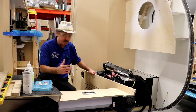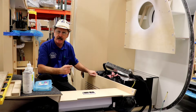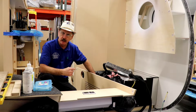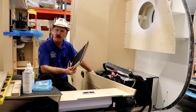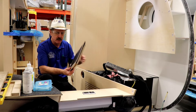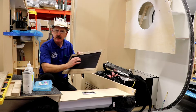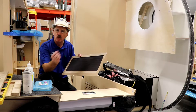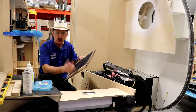Because this is an air conditioning unit, it does have a filter — a little foam filter that can be reused. It's just a little panel you pull off underneath your dinette seat. All you do is pull out the foam piece, rinse it off, let it dry, put it back in, and do that on a regular basis. You'll be glad you did.